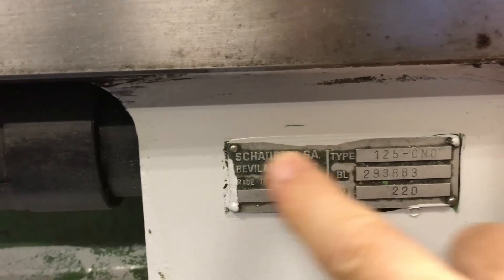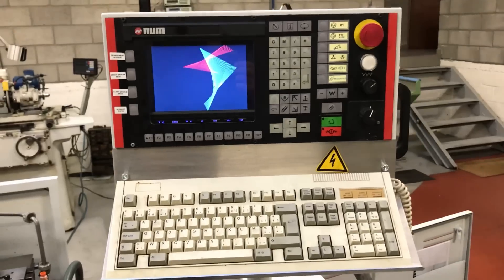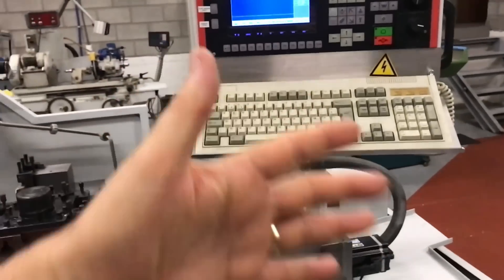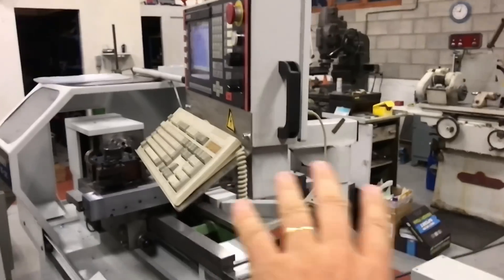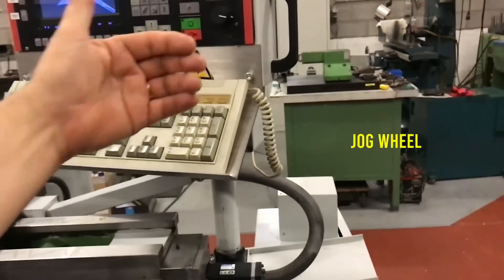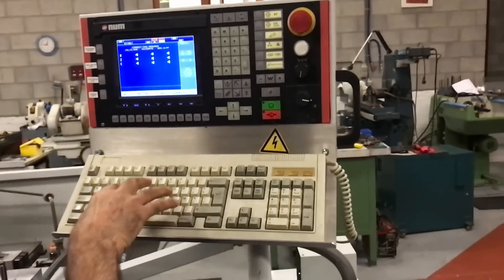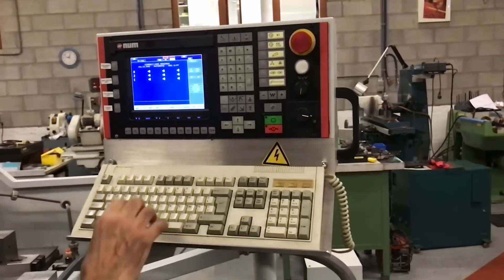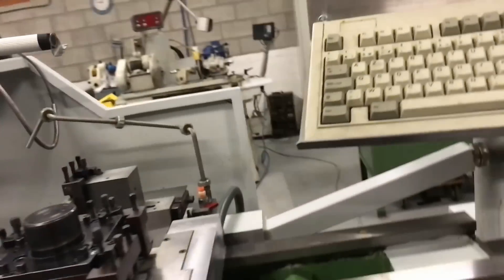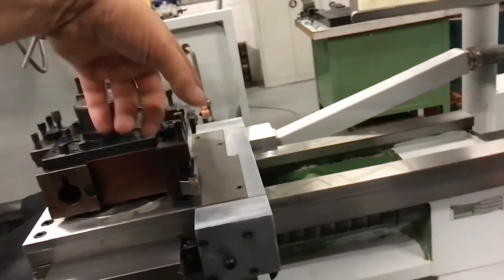Looks like we're going to have to do a little bit of polishing on this nameplate — we've got a bit of paint stuck on that. So this has also been lobotomized but it's got a professional controller on it. NUM — what age is the controller? About 10 years old, but it's new. Is this in your opinion the best possible height and distance forward? Not really — my plan was to put a head unit very similar to what you've done. I like how you've brought it forward because the original is so deep. You can key in the program and see directly, because sometimes when the keyboard is too far you have to look down, look up. This is well presented. I was kind of wondering whether I should clip into this cross slide dovetail and drop my two hand wheels off here, but I don't think I will because then I'd have to run all the wiring — I think I'll just put it here.